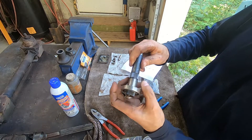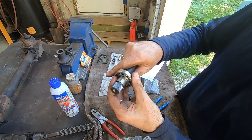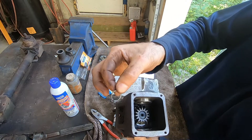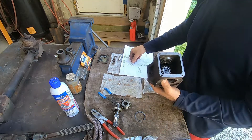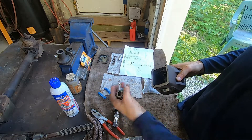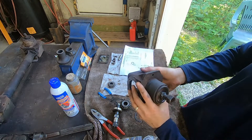When you move that snap ring, it will allow you to pull this whole shaft out. When it comes out, the bearing may stay in the housing, but in any case they come apart just like this — now you've got your bearing and shaft out, and when you slide the shaft out this gear will come out too. Now you're faced with another snap ring — a small one that goes around that shaft to hold that gear in place. With that snap ring out, this gear should come off; gravity will help. Then there's a bearing that you can leave alone for the moment.